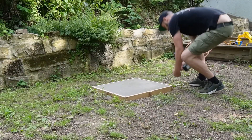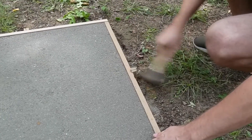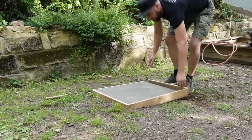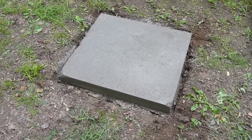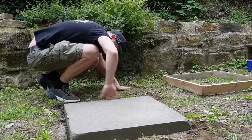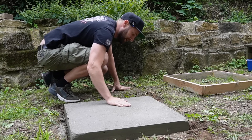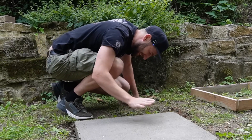After three days, I started stripping with great anticipation and excitement, but quickly realized something was still not quite right. Although the surface was actually hard and looked quite dry, it looked a bit different inside — below the shell. This is what the stripped foundation looks like now. It tore off the corners, which is not great. I probably stripped it way too early. The concrete is still moist and crumbly — it hasn't set properly yet. It takes significantly longer than with liquid concrete. We have to wait a bit longer for the stress test.